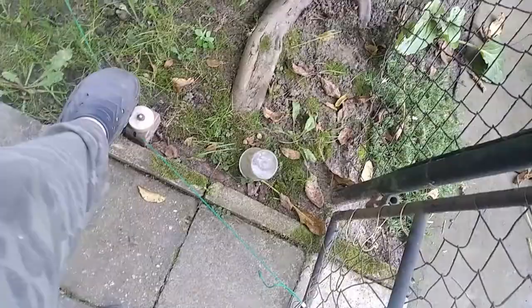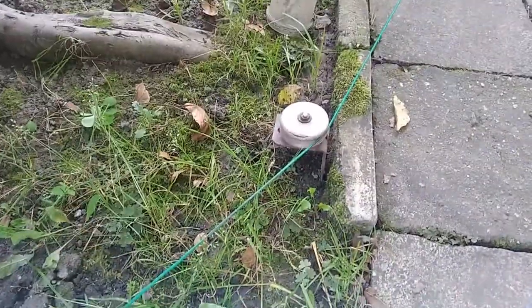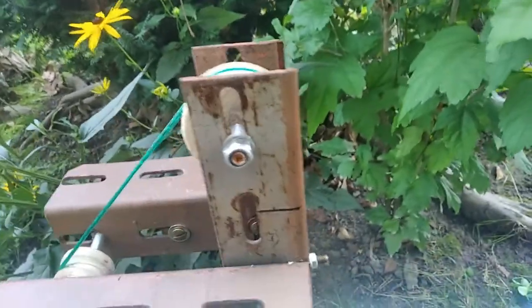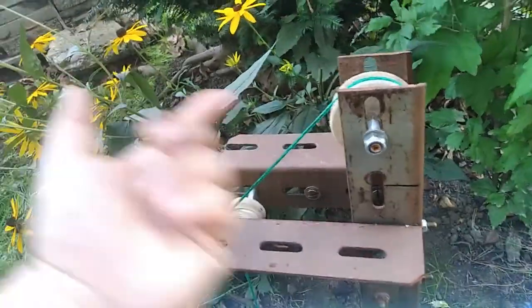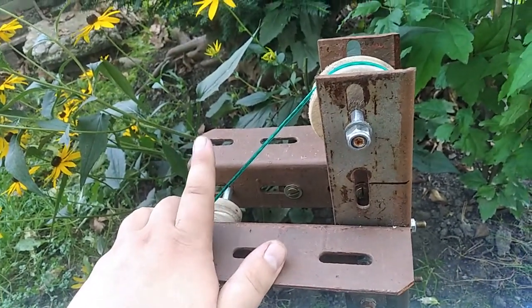One more feature I was thinking I might add is to bolt down a small roof or cover on top of this one as well. And maybe I am again overcomplicating, but I have this hunch that if I just put a flat cover, it's not going to do much good, because the rainwater and snow, once it melts down, the water will just flow around the edge of the flat surface and then underneath, and it will soak and wet those wooden pulleys anyway. So I think that all the covers would have to be slanted slightly, and that is just something I was lazy to do.